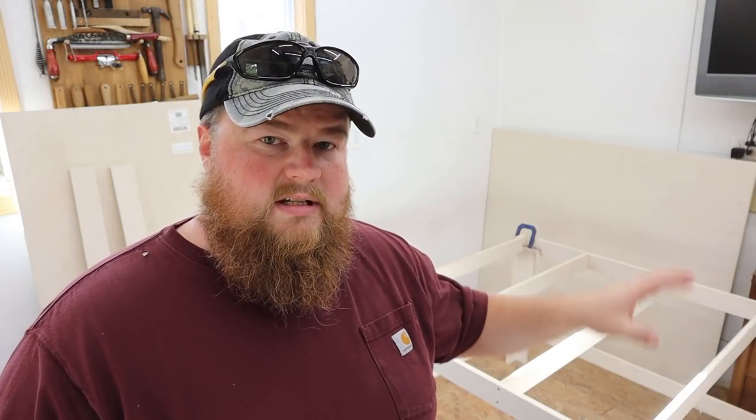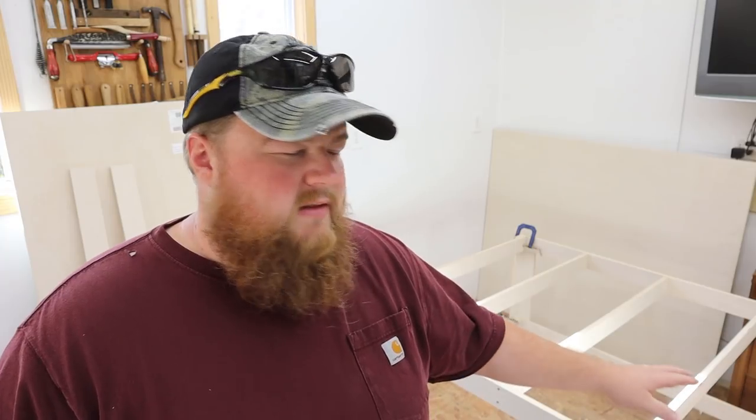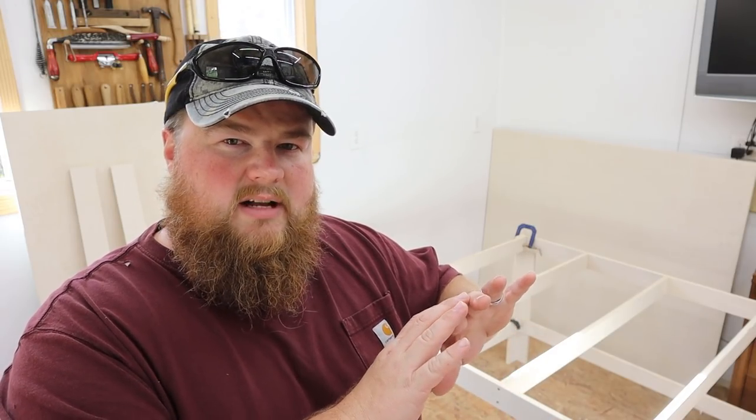It's been a couple of hours since gluing this all together and the glue is fully cured. I can go ahead and take the clamps off and now begin to glue on what I'd call stiffening skirts or aprons of the table. These horizontal pieces at the top I'm going to make all double thick, and they're going to lock in with the legs to keep the legs from racking or twisting. I'll glue those into place and clamp them. My goal is to give a nice clean, fastener-free face or presentation to the table.